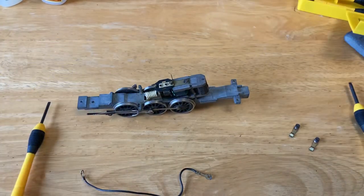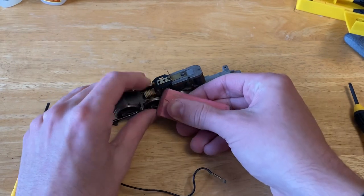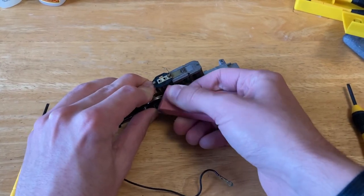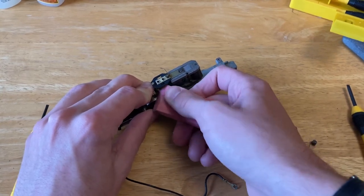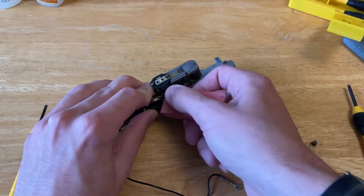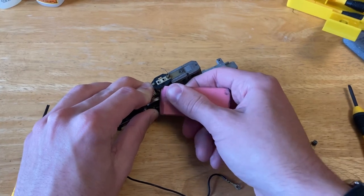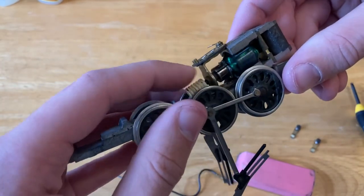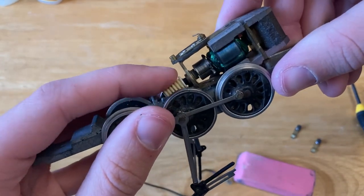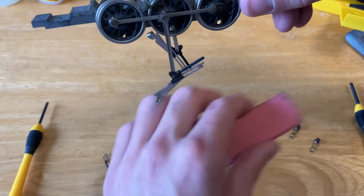What I'm going to do now is take an eraser and scrub at the inside by simply taking it in and spinning the motor. You can use a thick eraser — sometimes I'll just use one from an old pencil. Scrub at it for a little while and you can see it's a little bit better already. You can see where it's more black where I've scraped a little bit more. Going to scrape some more off camera.